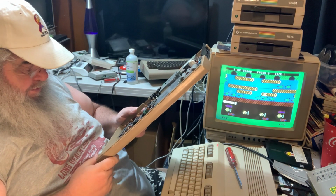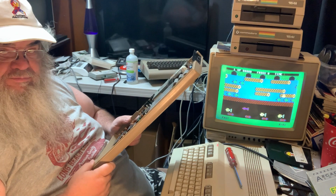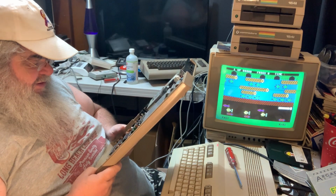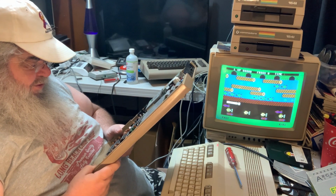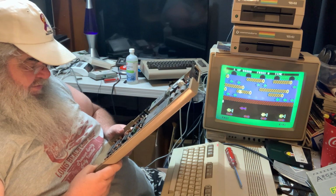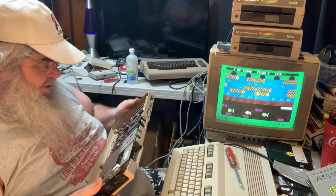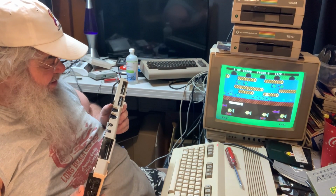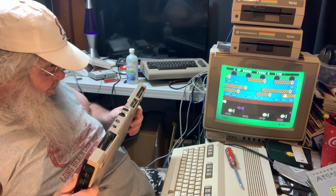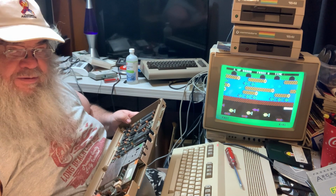There are a lot there. Oh, there are 5 RAM chips in sockets. This is unique. So the PLA is in the socket, the 6510, the 901227-02. And then 6526 and some RAM. So I suspect at some point this machine has had some repairs done. Especially, like, the RAM chips don't normally come in sockets. They just don't.